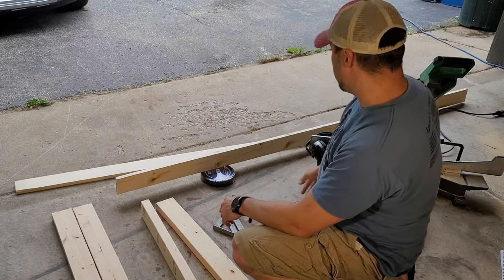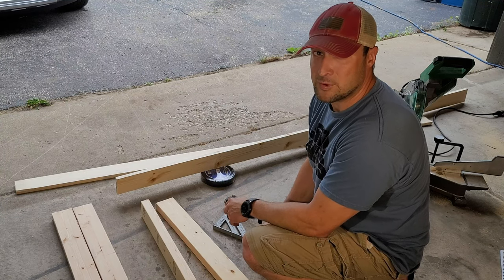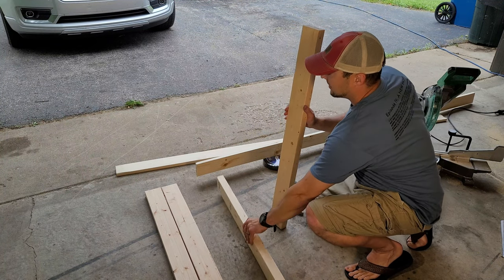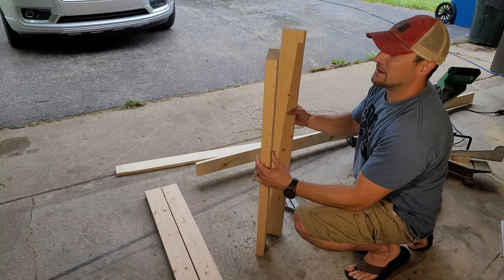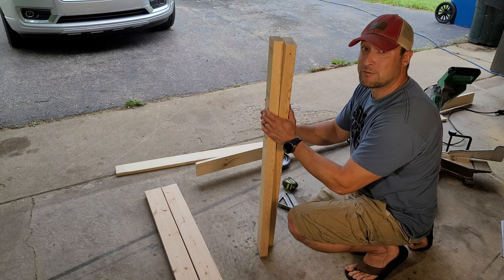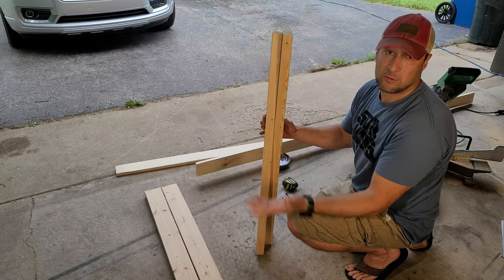Legs are cut — two in the front, two in the back. I used my miter saw; hand protection and safety glasses, don't forget that. Now I'm going to cut the front board. The table is four feet long, and since these two-by-fours are an inch and a half wide each, that's three inches total, so I need to cut the board at 45 inches — 45 plus 3 equals 48 inches, which is four feet.